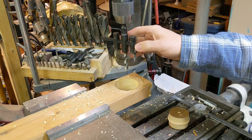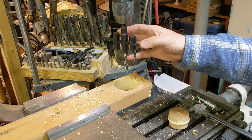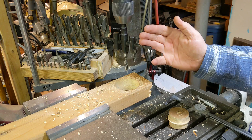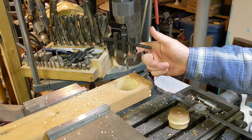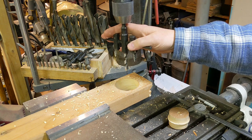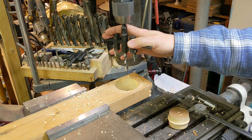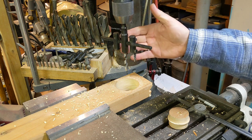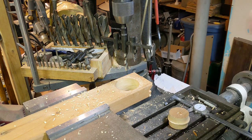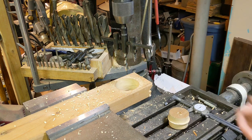One final note: you don't want to run this thing at a crazy high speed. It has a lot of inertia and it sticks out pretty far compared to a hole saw. This is a very dangerous tool — it can grab clothing, and it has pretty much razor-sharp chisels spinning around. I'd be hesitant to chuck one of these up in a cordless drill unless I really had confidence in the work being held still and my footing being solid. I'm much more comfortable using this in the drill press where everything is locked down and stable. There you have it — that is how you use a circle cutter, also known as a fly cutter, for accurate and clean holes of whatever size you want.